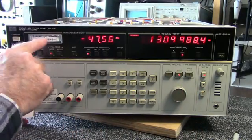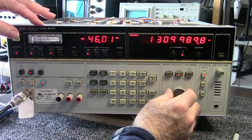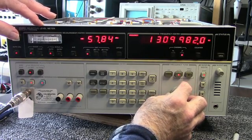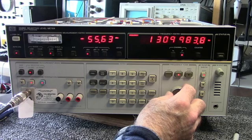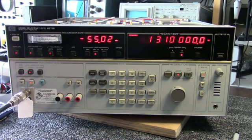Look on the left here, there's an analog meter and an actual digital meter here. You can see how as I tune into the signal the level changes. I'll come up onto the signal. It goes into a calibration. It does this every so many minutes, or if you change the frequency more than 1 megahertz. I'm terminated on 75 ohms because I'm actually using RG6 75 ohm cable. I've got a long wire antenna outside. It's not very long, but it's long enough for this.